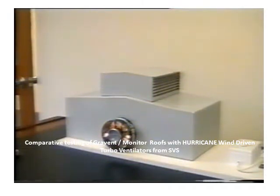The jack roof is actually taking air in through the louver blades and trying to exhaust it out the door of the factory. This is the opposite to what one requires under good ventilation, where obviously you're trying to exhaust the hot air from the factory.